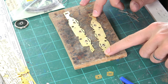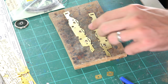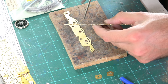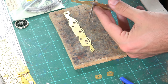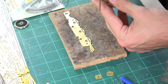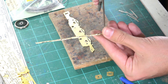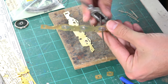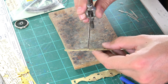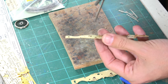All of the bearings are on nicely now and we're almost ready for frame assembly. I'm just going to ease these bearing holes ever so slightly with a one-eighth inch tapered reamer, just to make sure we're taking off any slight burring — nothing too significant. This is the right tool for the right job. Just a couple of turns on each hole.